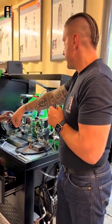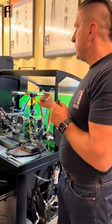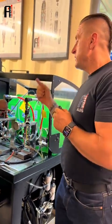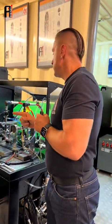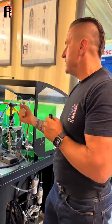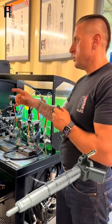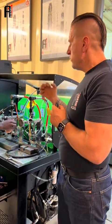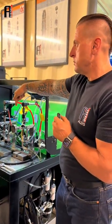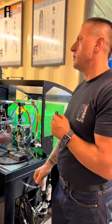But did you show him how to test the nozzle? No, I just tested. Okay, then right now let's put pressure on the nozzle and let's see. Then you explain to him what we need to see from the nozzle. Because this is actually the number one test — Bosch piezo. The first thing we need to test before we go. So we give the pressure, and then we see if the nozzle is leaking.